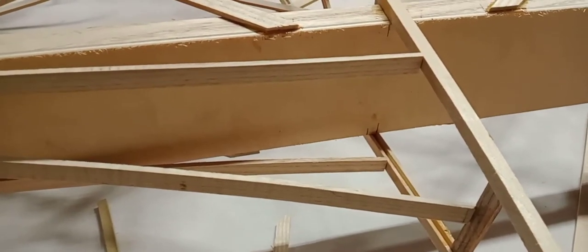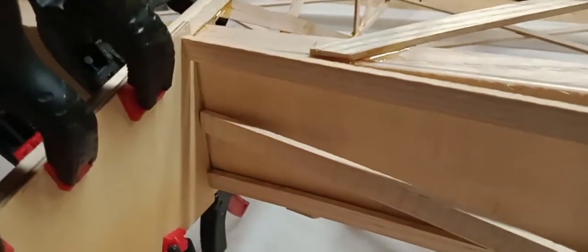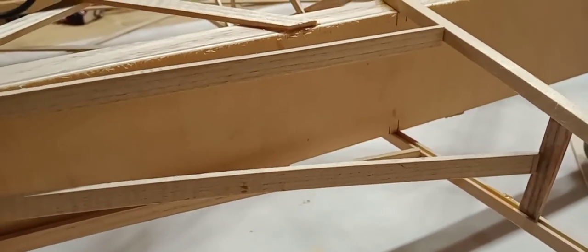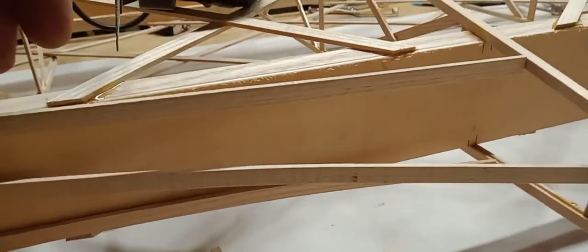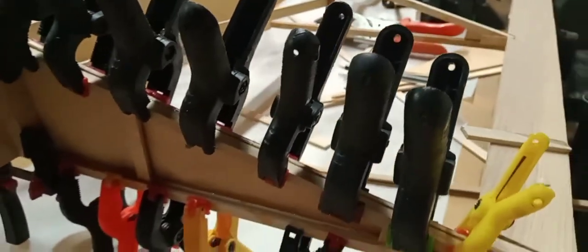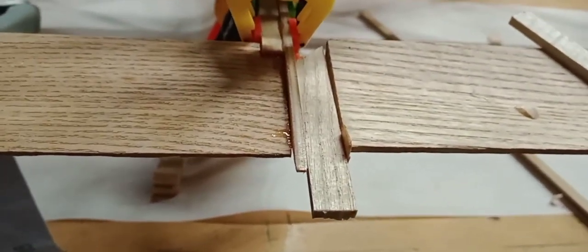So we have some creative clamping — two pushers at each rib cap going into the corner, and then one in the middle going to this vertical. You don't need much extra length; just like an eighth of an inch over this kind of a span is plenty — you get some pretty good pressure. And of course I'd like to clamp along this all the way. More creative clamping here — just shoved a piece of geodetic in there.